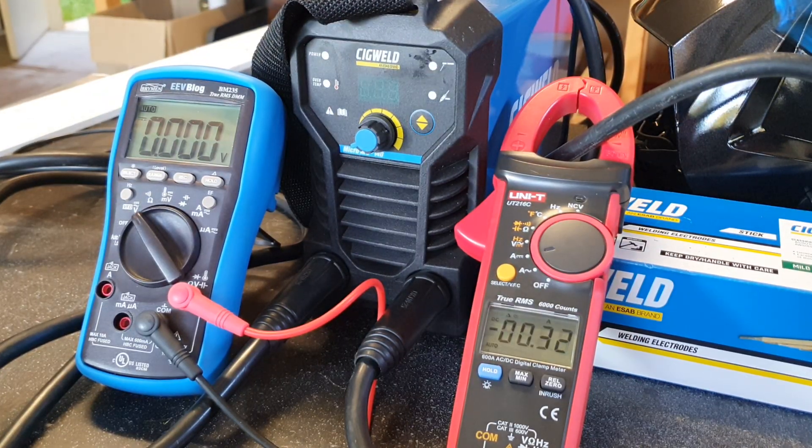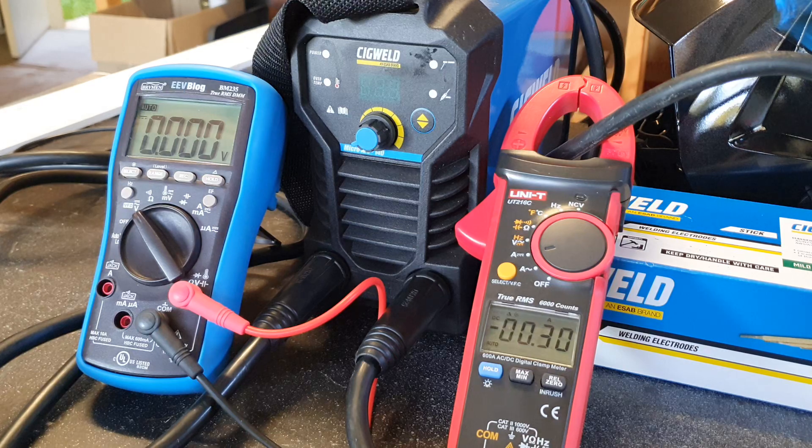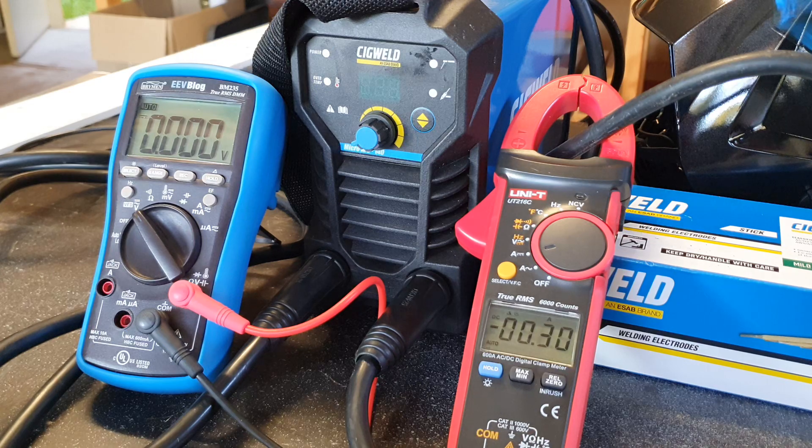Well, it indeed has delivered. Good work. My main conclusion here is you can more or less safely draw more than 40% over the spec power from your 10 amp outlet and you'll be fine. Just watch your cables not to get too hot.